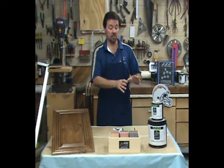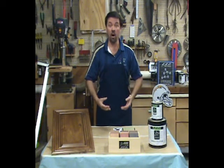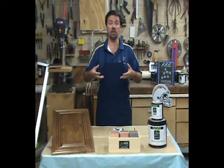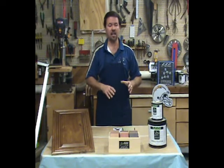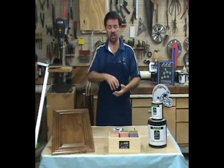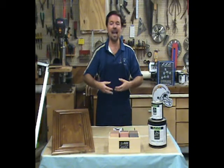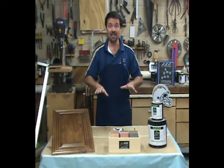The EcoSteps coating, my coatings, is a waterborne system. It's born of water. It started from water. The entire system is built with water in and around it. Where's the plus and minus in that? Toxicity levels and those things aside, what it does is when a water-based coating coalesces or dries out, it can't redissolve. It can't go back into solution. So once it's on there and dried, that's it.